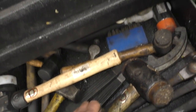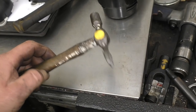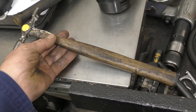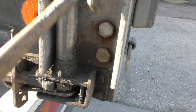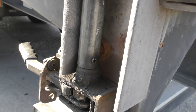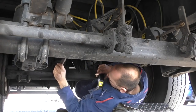This is the mainstay tool of British HGV technicians. A hammer like this is not acceptable - what you need is a tapping hammer, as we call them. This one gives you a tap, tap, tap, and you can tell if bolts are loose or whatever. You have a scraper on the end to scrape off corrosion or to tap. This is the UK fitters' mainstay for checking loose nuts and bolts, checking wheel nuts, checking nuts and bolts that are vital structural components. You can see that one's actually loose - anything that could fall off on the road is a hazard to other road users. I know the Polish fitters don't do this - they're quite surprised when they see us do this.